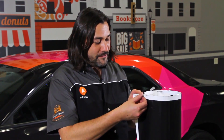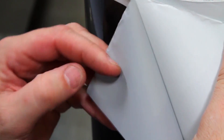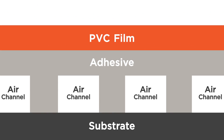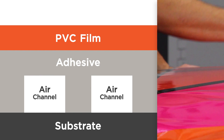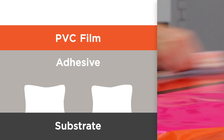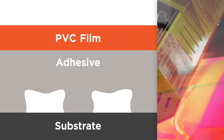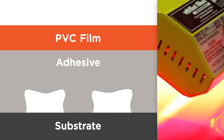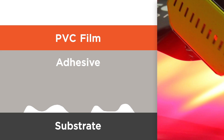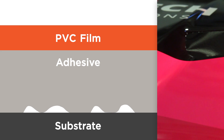The first thing you'll notice is that the adhesive feels light to the touch. So how does it stay down? Here's a quick look at how the bond increases. When pressure is applied, the adhesive wets out a little and makes contact with the substrate. As time elapses, or post-heat temperatures are applied, the adhesive wets out more and more contact is made, building quickly to its final bond strength.